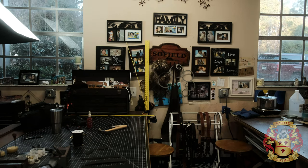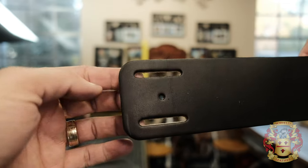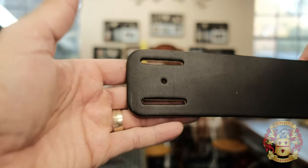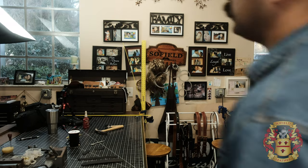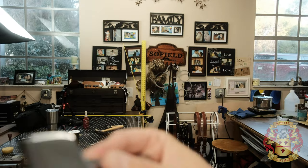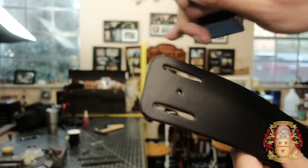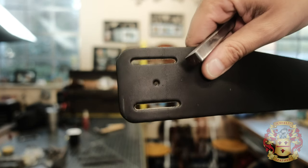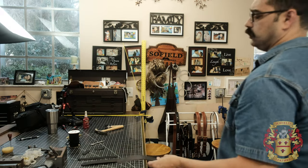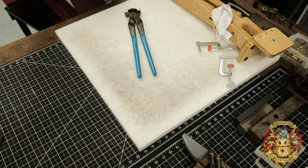On Alpha, for the oblong punch location, it's easier to come down half an inch from the top and half an inch from the side, and start your oblong punch right there at the top. That's a little shortcut rather than doing the math from the print, but it's up to you. Alright, let's assemble.